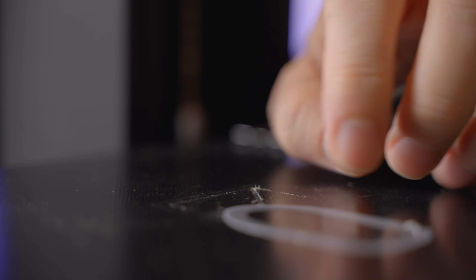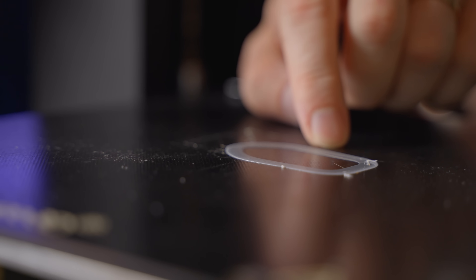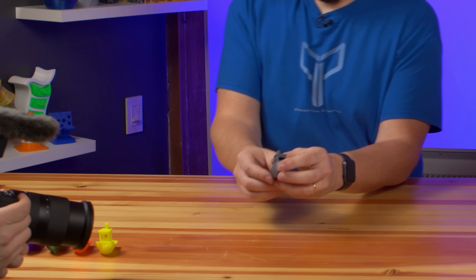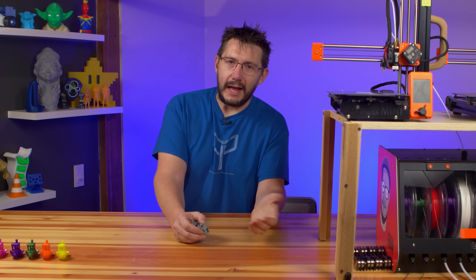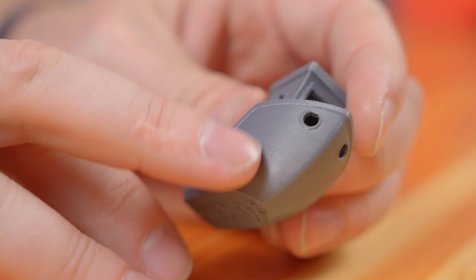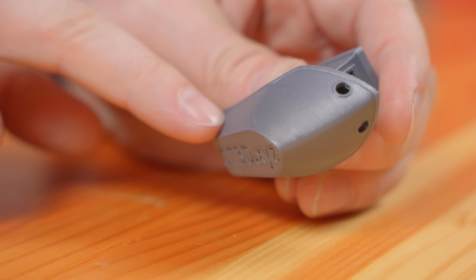On to the Kaiwu 3D Tycoon. This one didn't come with a slicer or slicer settings, but the G-code on the SD card said it was configured in Simplify 3D, which lets you import G-code to create a profile — so that's what I did. I also added a bunch of skirt lines to prime the nozzle. It was printing at 200°C; Pooch did say that's a little cold for his filament, and a bit more heat might have improved the side quality.